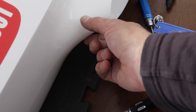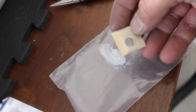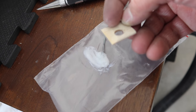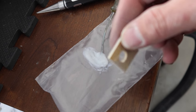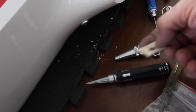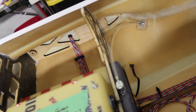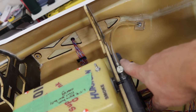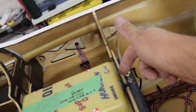I'll take a piece of plywood that fits the fitting hole, put it on the inside of the fuselage for support, and tighten the nut. We've got our hole done, fitting inserted, mixed up some five-minute high-strength epoxy with a backing piece. The backing piece goes on the inside of the fuselage and the nut goes on top, with some epoxy on the back side to bond it and take up any angles. There is our vent line — nice, clean, and short, no breathability issues with this massive tubing.